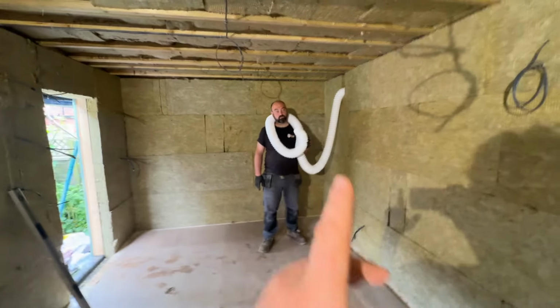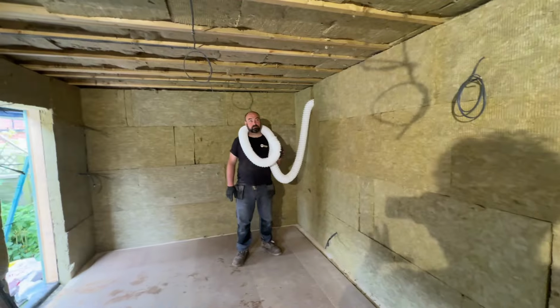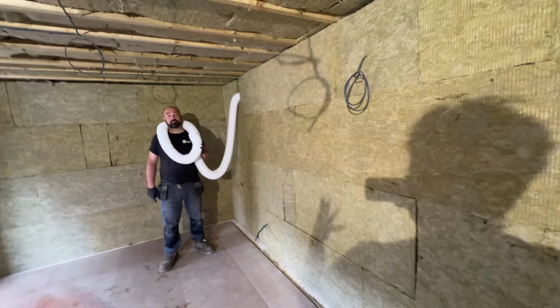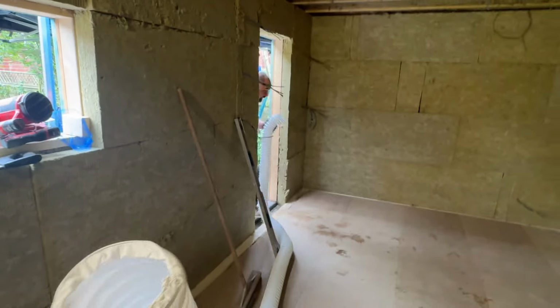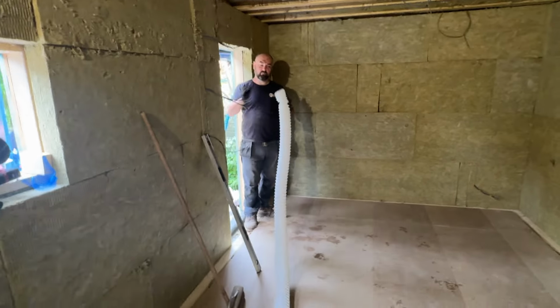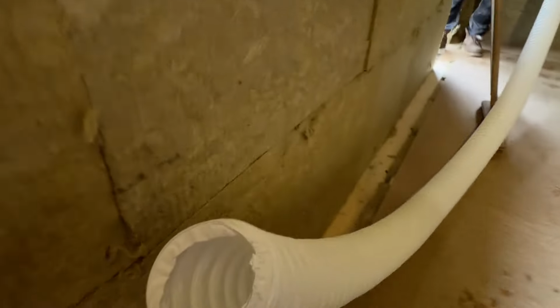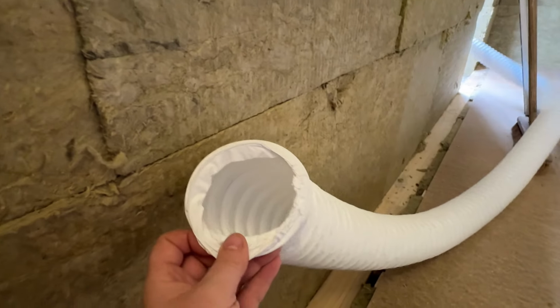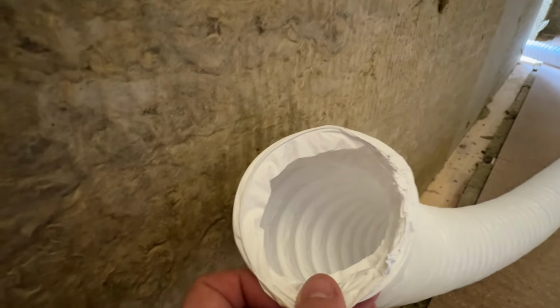What we'll also do is just demonstrate quickly how good this ducting is, because people make these huge baffle boxes for outside the room, which are good, but you don't need them if you've got space to hide the 6 meters of ducting. So what we've done is just to kind of emulate what this would be like outside, because you've got to remember all this ducting is going to be in Rockwool, right? Sort of in between the 2 ceilings. So if we just get PJ to go out of the room, just slightly, I'll go down here. You set exactly the same volume. Right, you're going to hear it through the window more than through here. But anyway, go on, PJ.